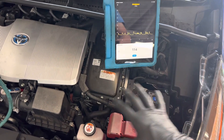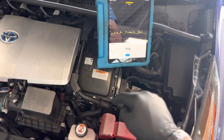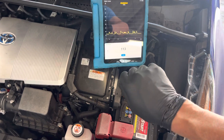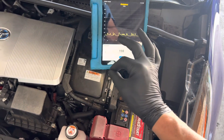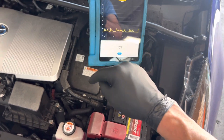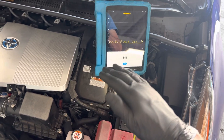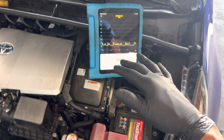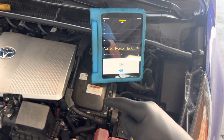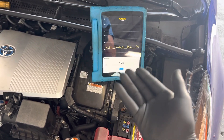The same thing with your frying skillet filled with oil — you go to a certain temperature, and then all of a sudden you start noticing it doesn't crackle as much. The crackling sound goes down, and you start noticing the little bubbles that form at the bottom from moisture start disappearing and are no more. You have raised the temperature of the oil to above the point where no more moisture can be removed, because you've risen the temperature above what's needed.